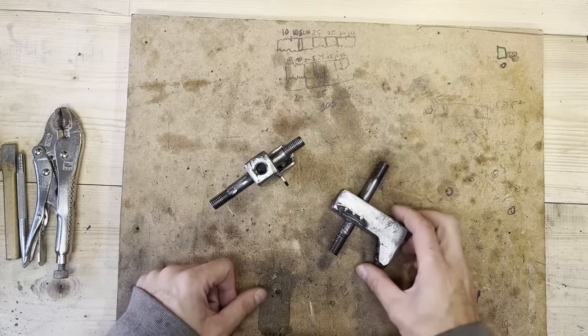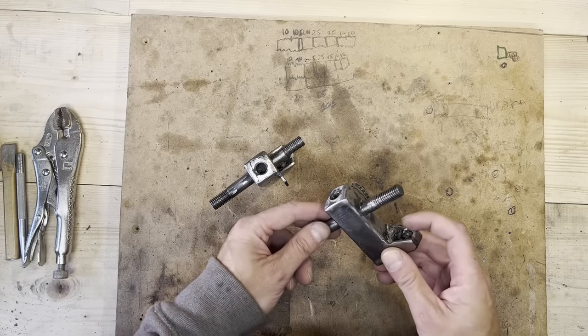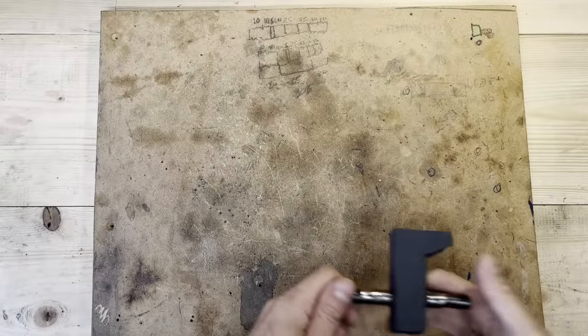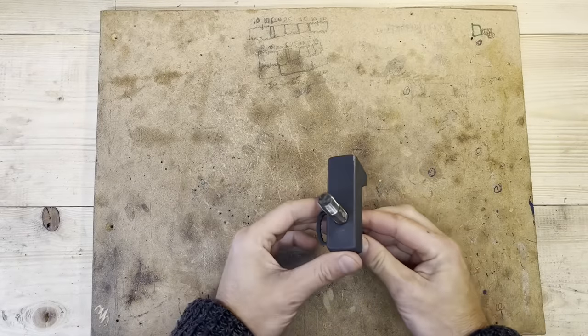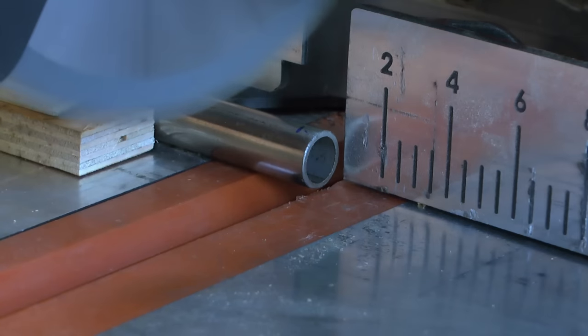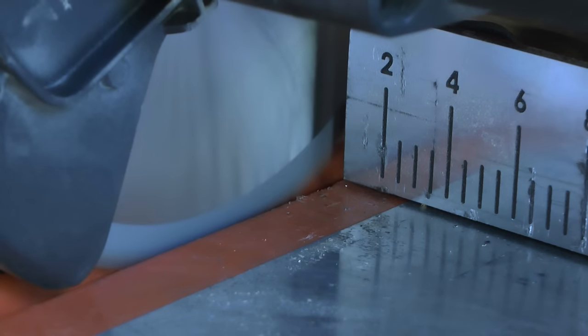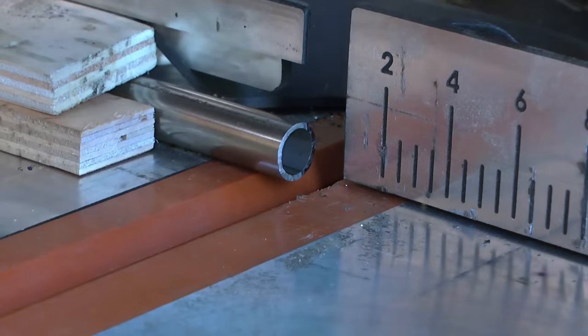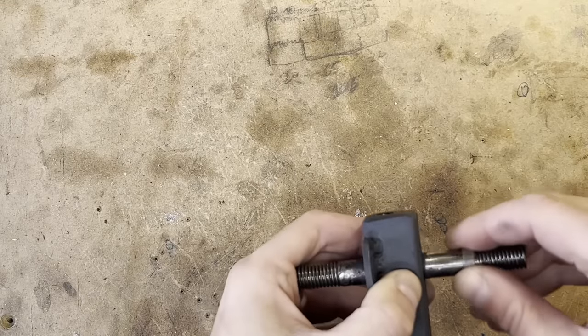Alright, then I'll weld the nuts. There are M12 nuts that will be used to secure the wishbones. I welded the axles and that bracket. And I just forgot to make this spacer that is needed to space the wheel hub from the knuckle. So yeah, let's put it there.